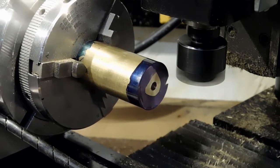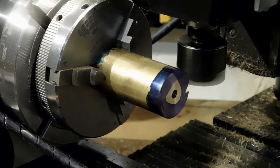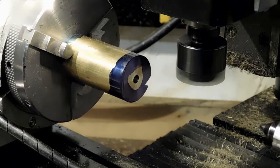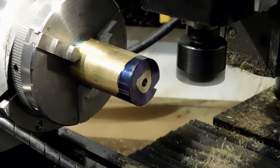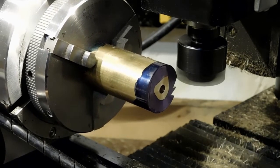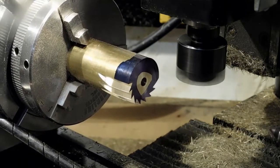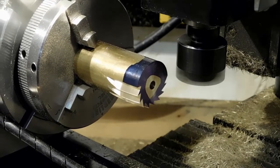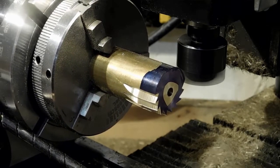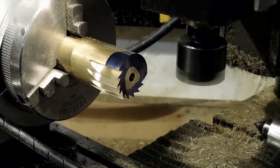We're cutting the ratchet here using a six-degree offset, very similar to what I did when making the small ratchet in one of my other videos. I'm cutting rather deep because I'm actually going to cut two or three different ratchets out of this, just to throw a couple in my box so I've got some for other jobs.